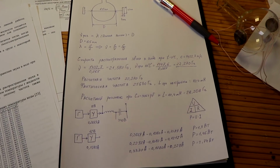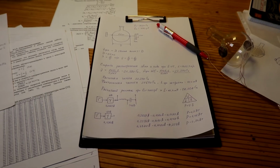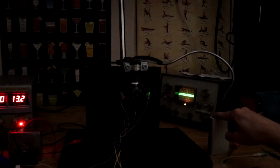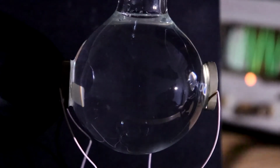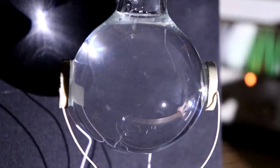Next, a calculation was made of the power consumption of the device at the time of the birth of a neutron star. The audio frequency amplifier itself at idle consumes 100 milliamps, therefore we exclude it. On different days of conducting the experiment, the current consumption during sonoluminescence was different, because the average power ranged from 1.5 to 3 watts. When it is possible to catch a stable bubble glow in the center of the acoustic chamber, it can be continuously observed for several minutes.